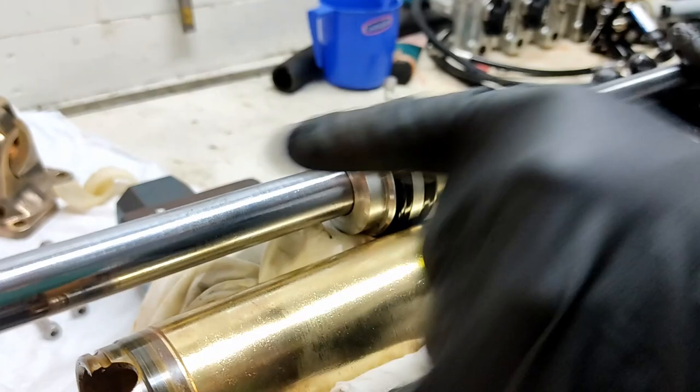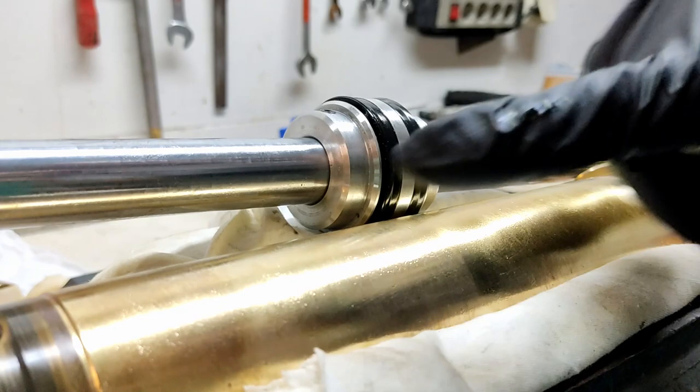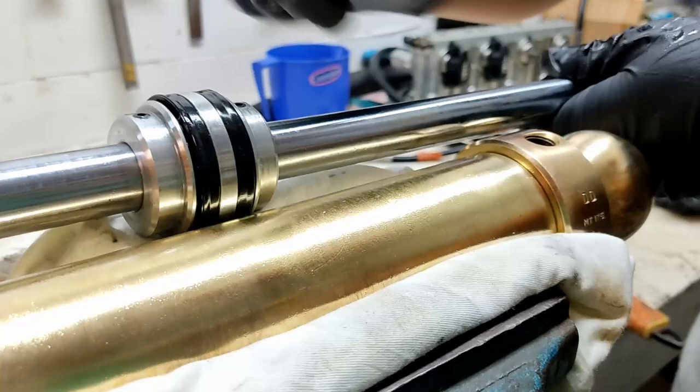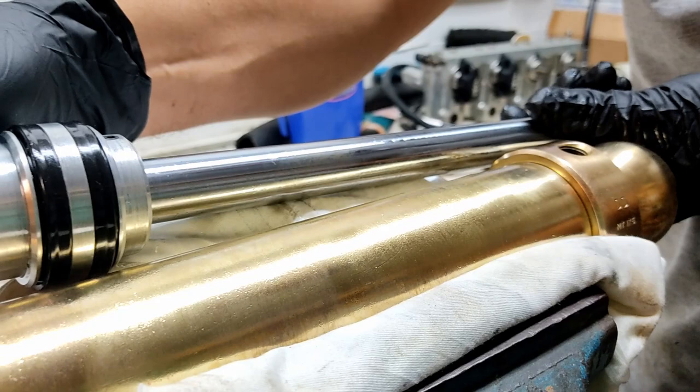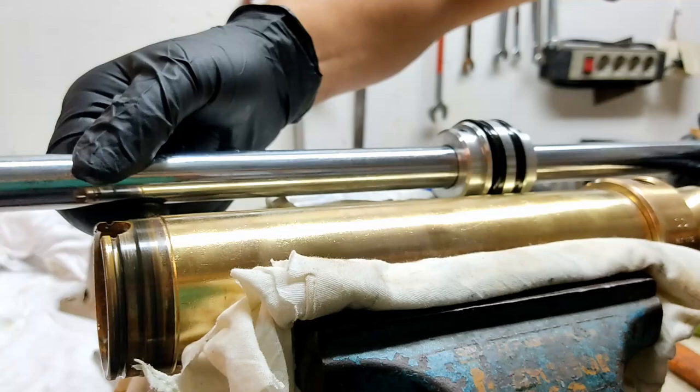This ram was in here, as you just saw. This piston here was sealed up on the inside wall of here. Now the oil goes in this hole, or in this hole. And when the oil goes in this hole, the oil will fill up this cavity, create pressure against the piston here, and push the ram that way. Then we fill up the hydraulic ram through this hole here. Oil goes in, fills up this chamber, pushes on this seal, and the ram goes back in that way.